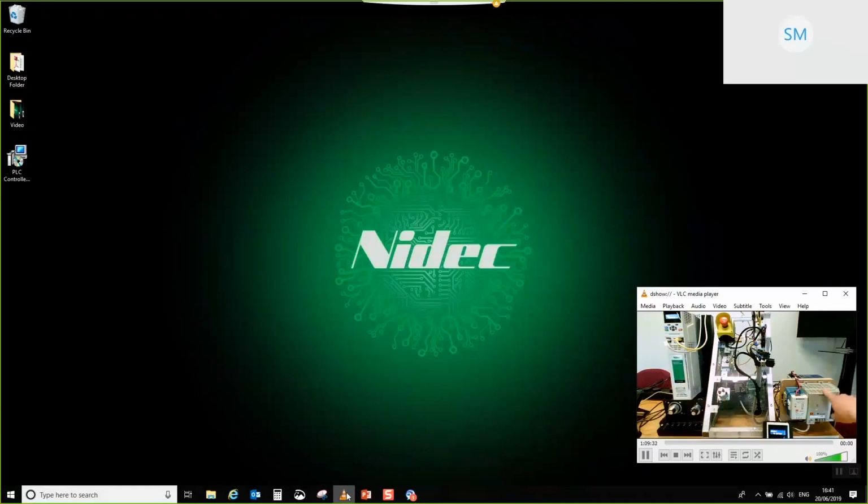So this is my L24ER PLC. It's a cheap compact Logix PLC, but as you'll be able to see, you can do everything that you want to do for this application with it. Here, it's a bit difficult to see on the feed, but this is a Digitax HD M750. And then everybody should recognize this guy because they've been out there for quite a long while. This is the Unidrive M700 demo case. And in my case, I've got a multi-protocol factory-fitted Ethernet module fitted in there. Obviously, for Rockwell, you don't necessarily need that, but with this same rig, at the drop of a hat, I could swap it over to a Siemens PLC if I wanted to.